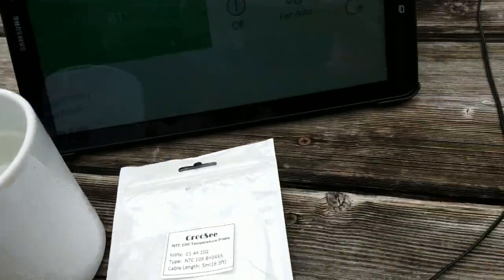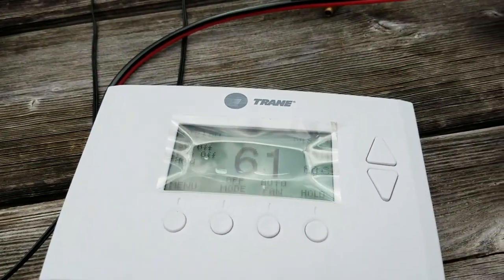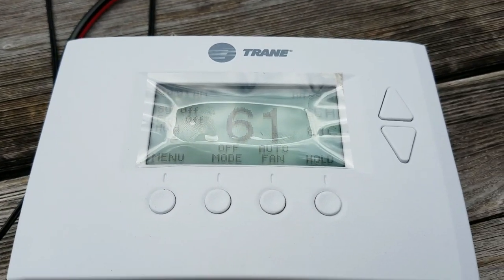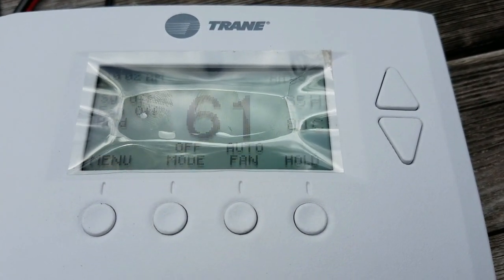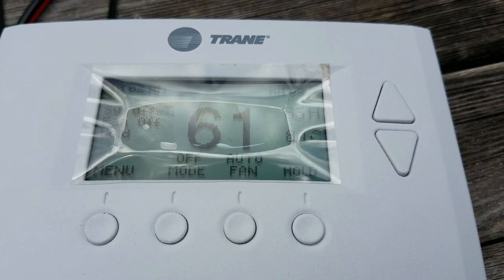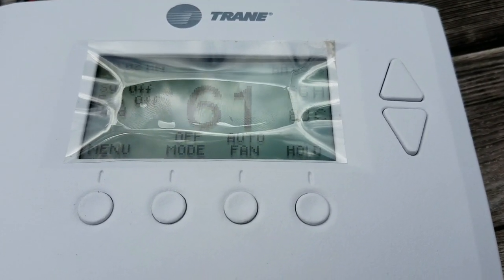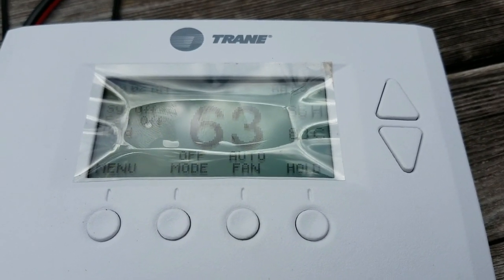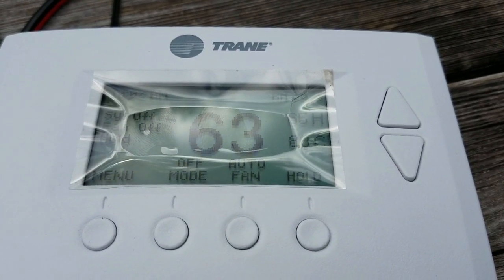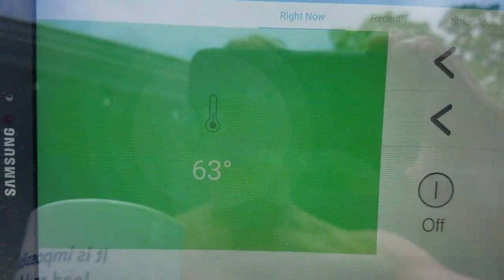I'm going to bring that out and let it warm up. It senses quite slowly — that's just to stop it flicking your AC on and off; it only samples every few seconds so the temperature will take a little while to stabilise. That's a good thing because you don't want the pump continuously flicking on and off through random fluctuations. You can already see it starting to climb, jumping every 5 or 6 seconds or so.